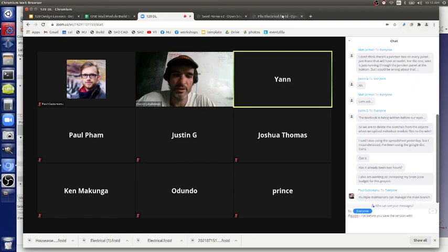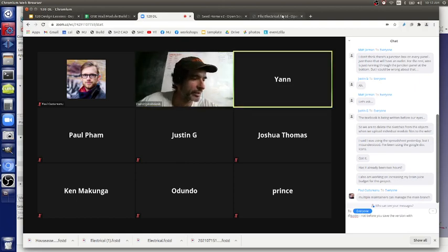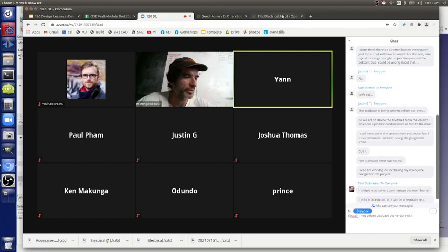Yeah, but right now what you do, so you are just placing manually, or even if you use a property value, like to give millimeter position, it's not based on constraint. So it's not an assembly that you are doing. You are placing parts next to each other. Yeah. That's wrong. And I can see that you will make it work for this project, but that's not mechanical engineering. And I should give you also my bias.